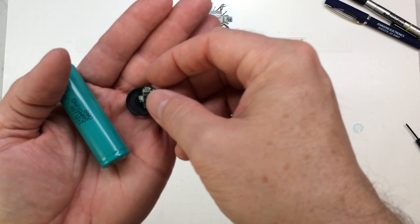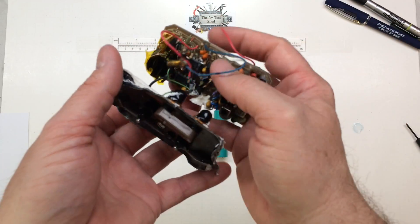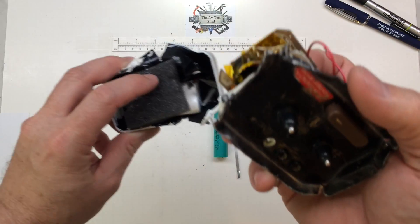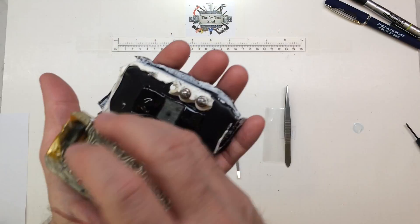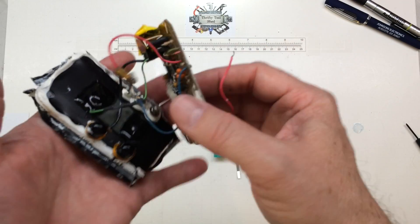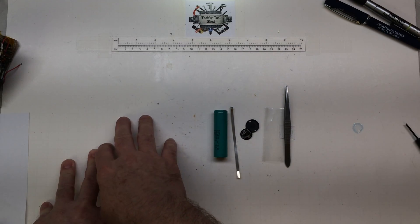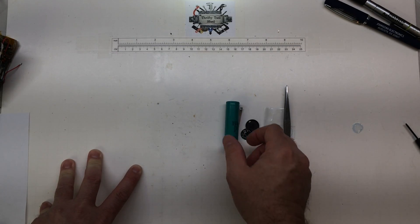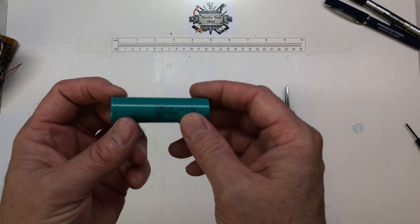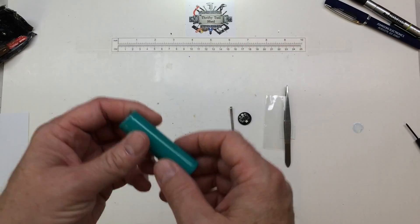It gives a little bit of battery protection from overcharging, over-discharging, and overcurrent — short circuit protection as well. The reason I'm working on this pack is I'm in the process of repairing this dog training collar, which was terrible to get into — definitely made to send back to the factory. It had a NiCAD battery in it, which was horrible for corrosion. This is a separate video about making this battery pack to take the place of a 3.6V NiCAD pack, since the charger has no battery protection built in.